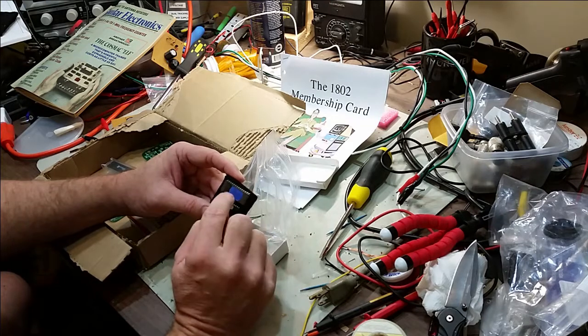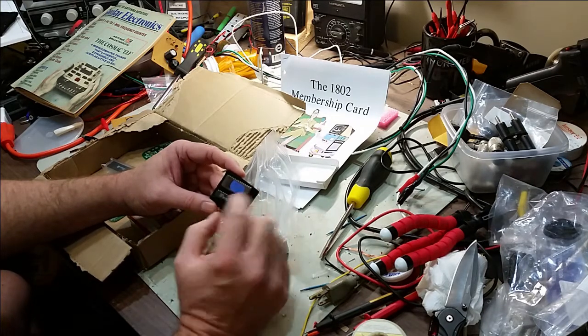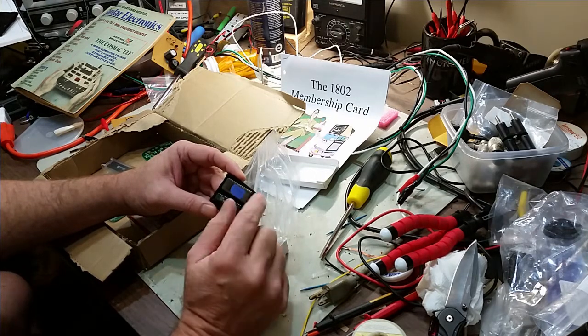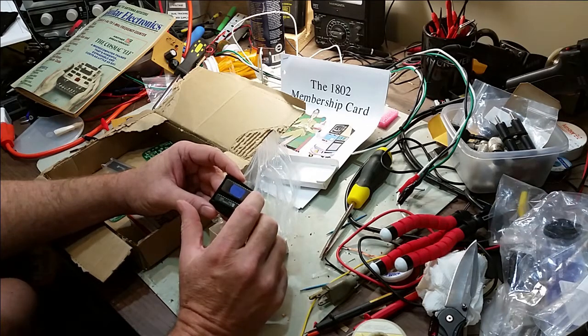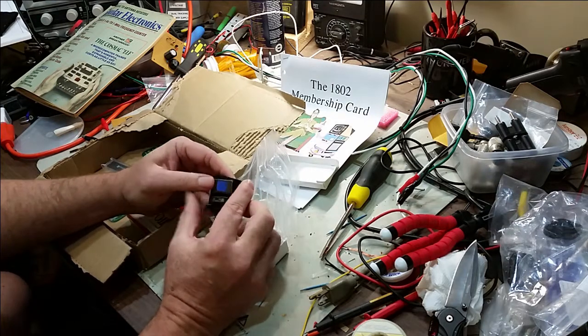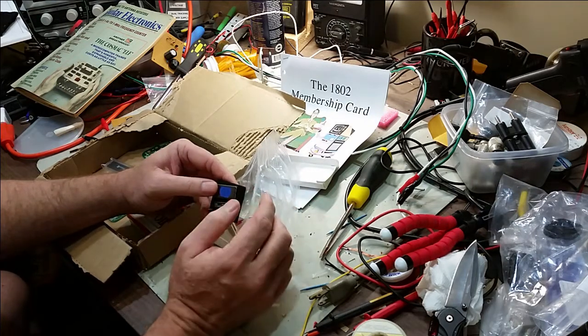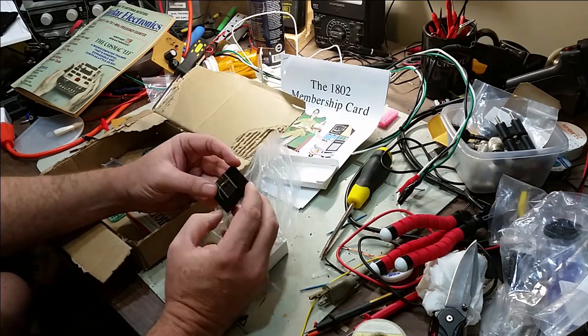There's actually an EPROM that sits over the top of that chip. The RAM will be down inside the socket, kind of hidden away, and the EPROM will go over it. This particular EPROM has a monitor called the IDIOT monitor, which basically gives you some quick and dirty ways to test the serial port and also an easier way to enter programs and things like that. There's a zero-height socket used for putting in the memory card, and then a capacitor for bypassing the noise.